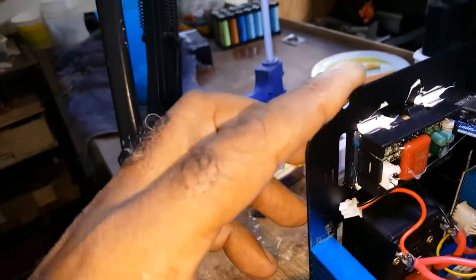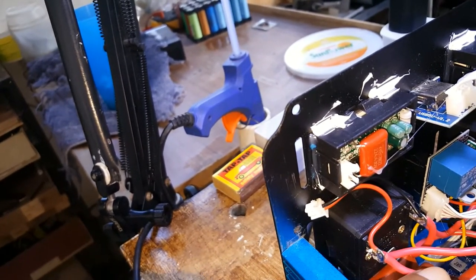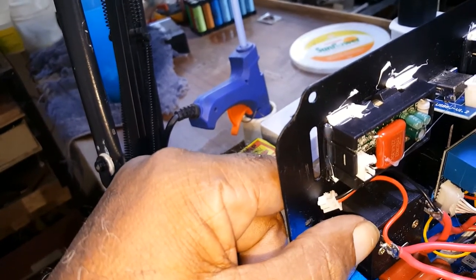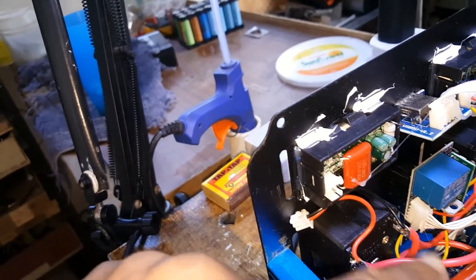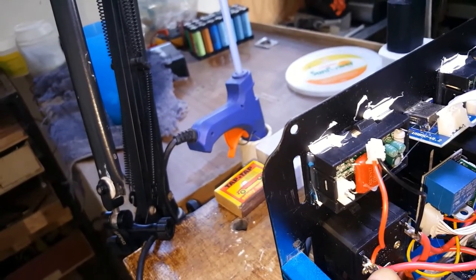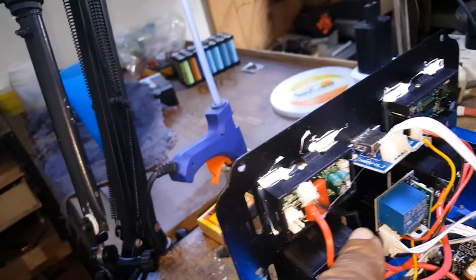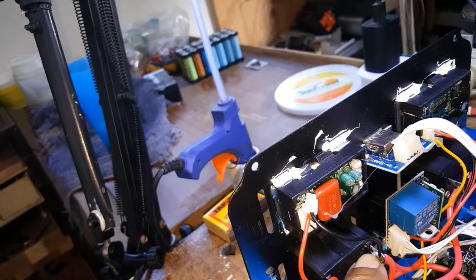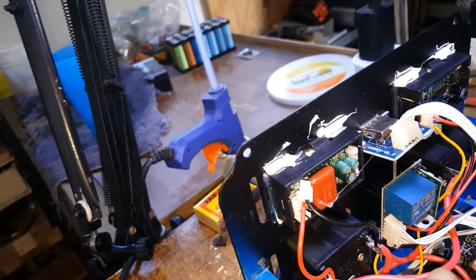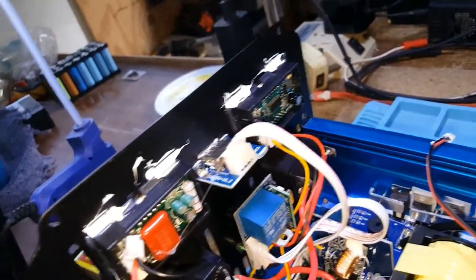The other thing is the wires are back to front. If that is live here, it's where the neutral is. Because according to the outlet, it marked live and neutral. And that isn't corresponding. Because I go according to this. This is supposed to be live here. But on the plug itself, it marked neutral. This side here, where the neutral is connected, marked live. So I will be taking out that, and then when I put everything together, I will put power to it and test these outlets to see which one is live and neutral.